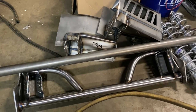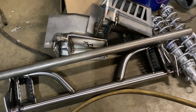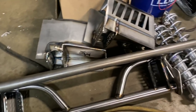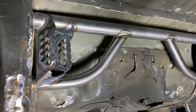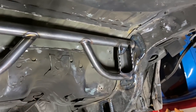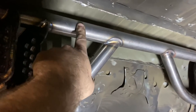This is some of the stuff that's happening over here at Brian's shop at BNK Performance. I think this is the third or fourth car now that he has put uppers and lowers on. These things are awesome — four-link in a box. Here is the Marty Marlatt stuff on one he's working on now. He hasn't quite got it done yet, but you have to basically cut out all the upper stuff and then this just goes right in place and welds in.